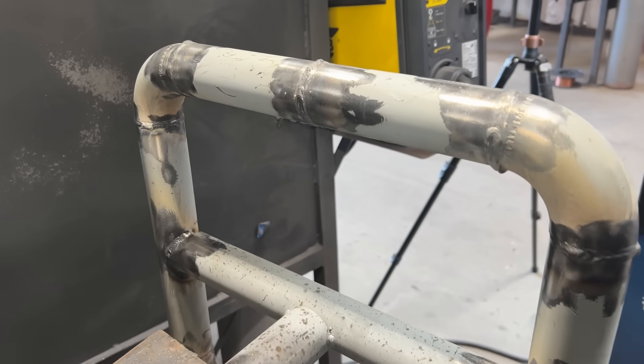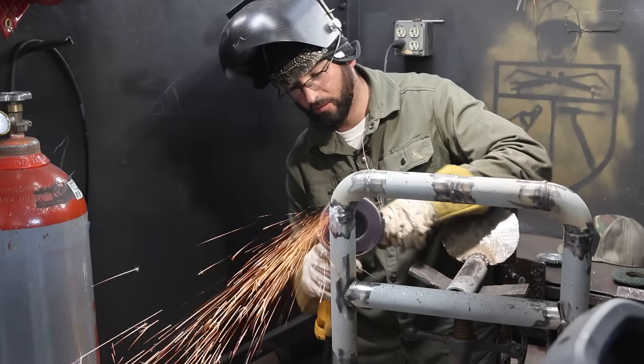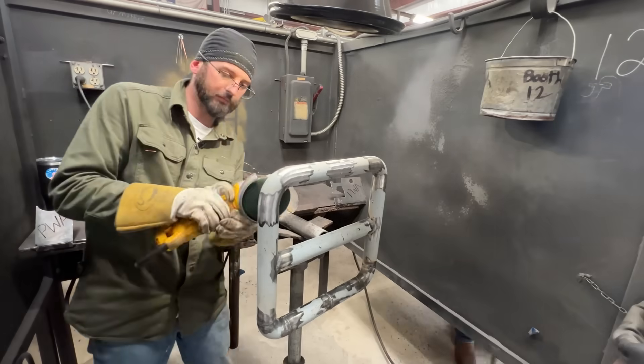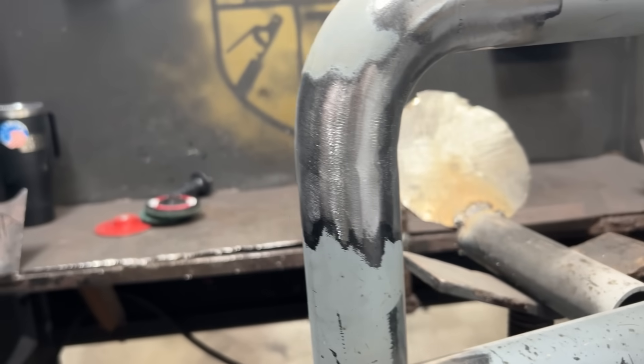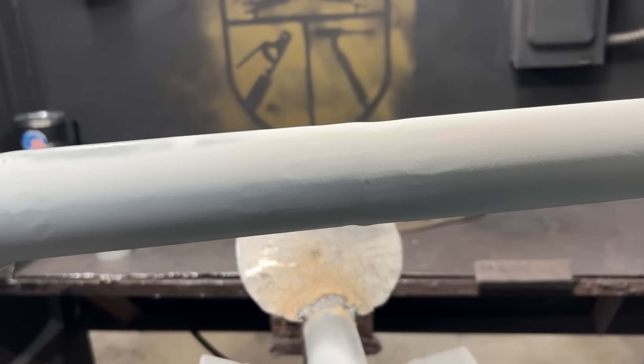After all that welding is done, you might notice a low spot or a high spot — now it's time to blend. That's the whole point of having enough metal there in the first place. If you see a low spot, go ahead and fill it up, even if it doesn't look good, because we're going to sand everything down. I'll be honest — I got into a bit of a hurry at this point. Even with an angle grinder you can be pretty consistent with finishing, but I was rushing. You can always take off a little bit more; you usually can't put it back. We kind of dished out some of the sides of the welds, and even after paint it isn't the most desirable finish — it was smooth, but you can tell we didn't take the meticulous time needed with the right tool.